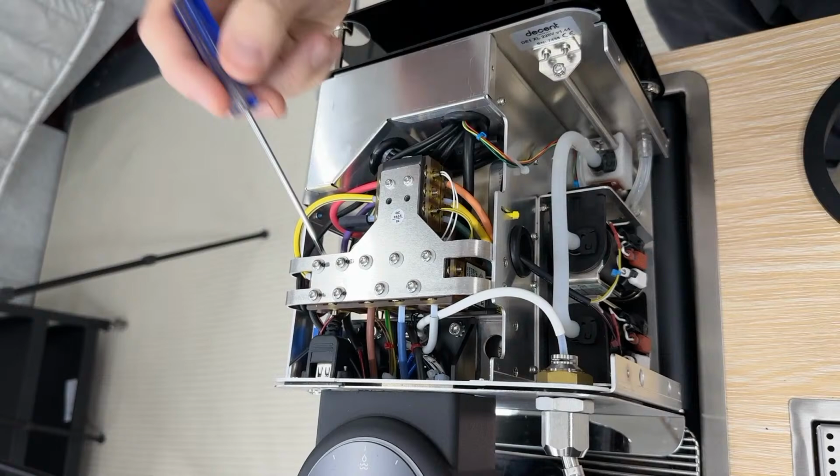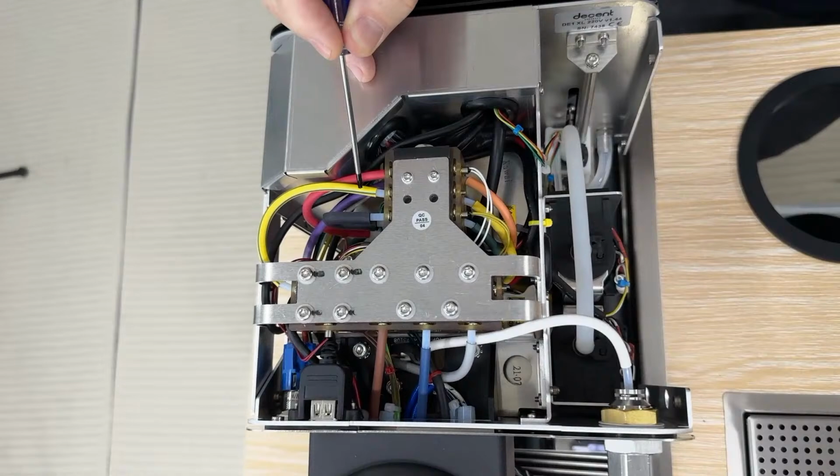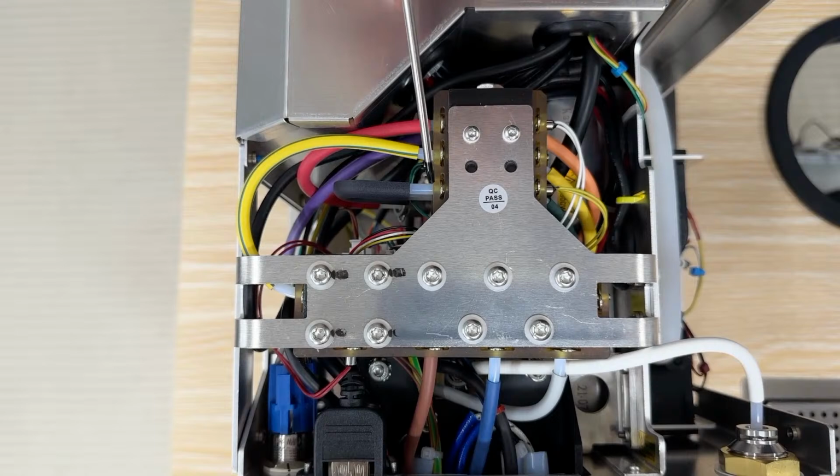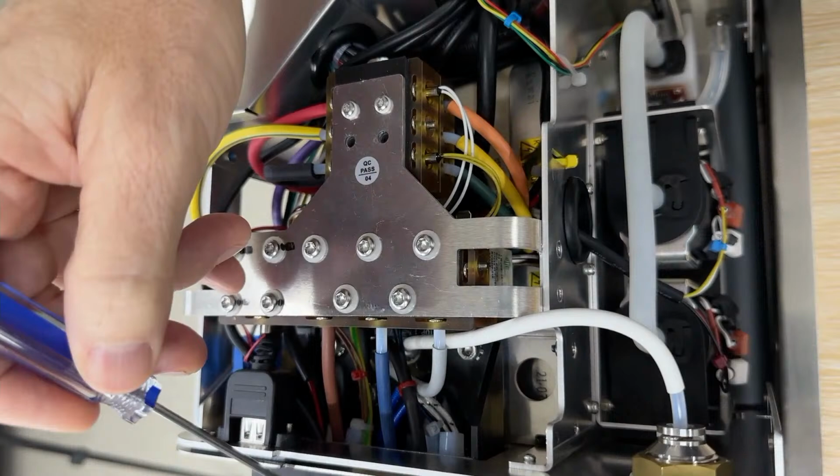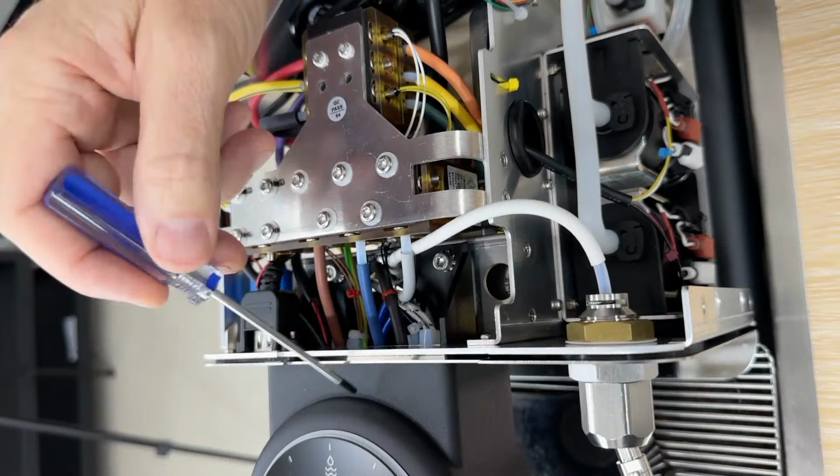Now you'll notice these tubes here are quite thin. They have a 1.3 millimeter internal diameter, but actually at the ends here where these come in, they're 0.8 millimeters. And the reason we use quite thin tubes is so that there's very little water that travels between here and here and here, so that a change that happens here happens maybe less than a second later over here. Not much water, not much latency.